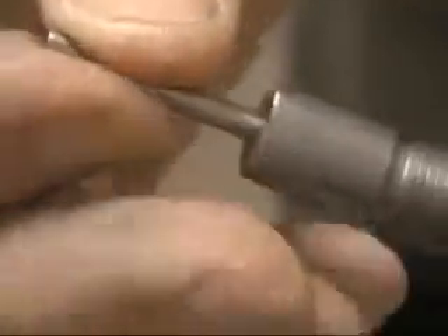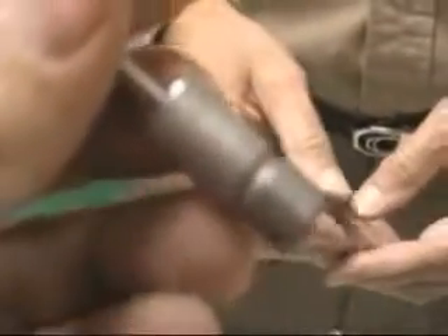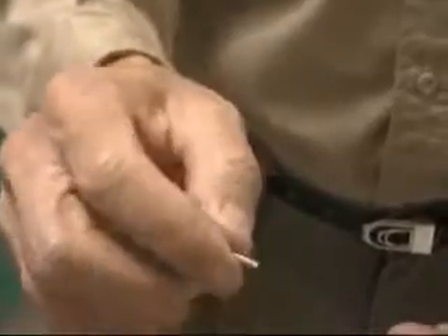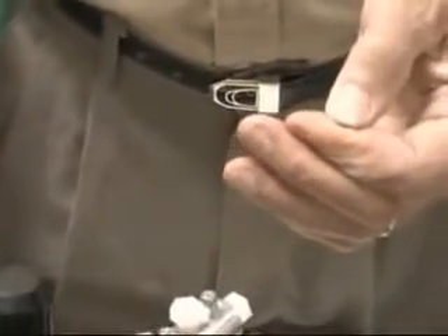That orifice is about the right size. You can come all the way over with a quarter-inch tube and then deliver through this small orifice or any other small orifice. It resembles a type of hypodermic that would be used around a veterinarian supply, so you might think of picking one up from a vet supply, or even a basketball fill port. The outside and inside diameter is about a sixteenth of an inch internal.